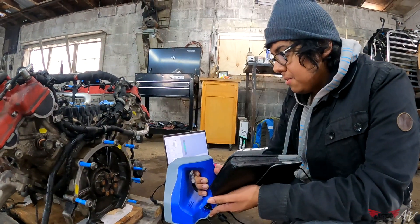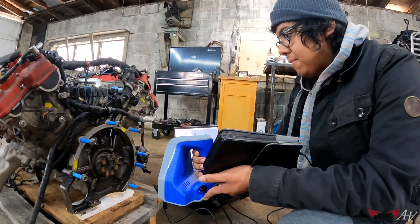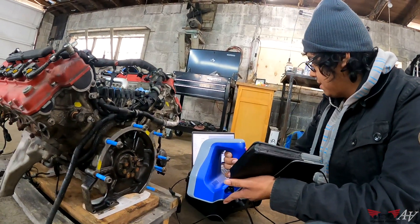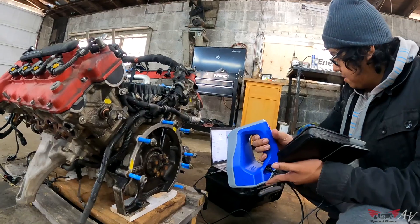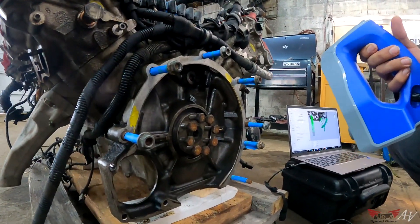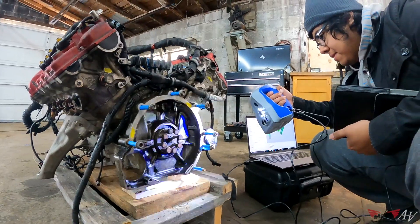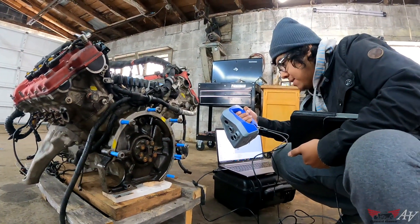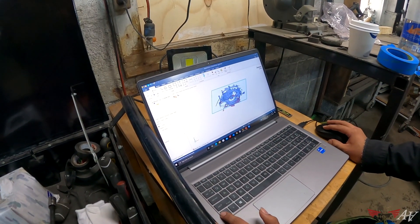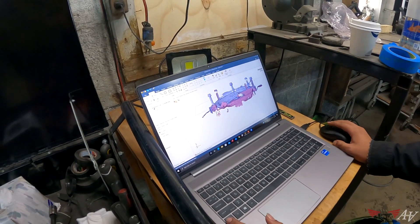The way the scanner works is off of light and picture — if the light reflects back it screws up the picture. If I put masking tape on it, the dull color surface should work out a lot better to pick up surfaces, because before the bolts were reflecting and not creating a nice circle. I started with the STL, imported it into SpaceClaim, added a plane, and roughly leveled it off the flat surface.